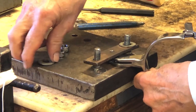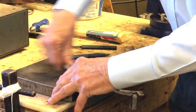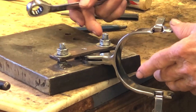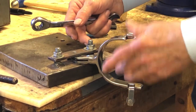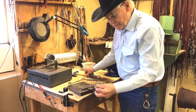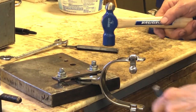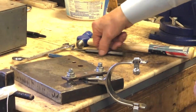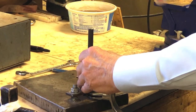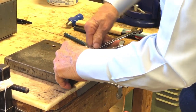It's got a hole that's just the size of the rivet. I put this on top — if you're doing it over just a hole you need somebody to help you hold it lined up — and we tighten this down where it holds it real snug. This is a piece of one-inch steel I had built for this. You can do it over an anvil but you nearly always need somebody else to help you hold it. Be sure the hole is not too big. First I take a little center punch and just start the rivet out, and it moves about an eighth of an inch; then I take a punch that is a round shank the full length.